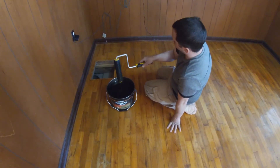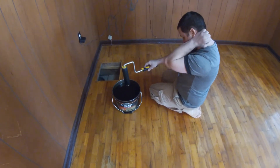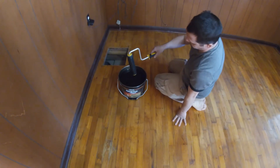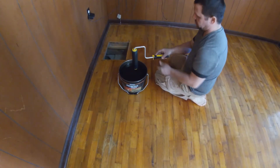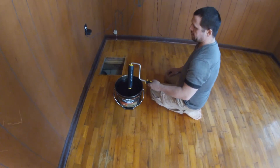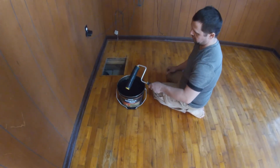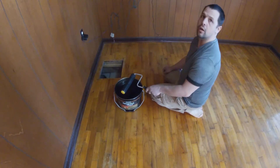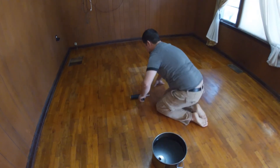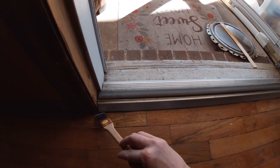All right, we're getting ready, starting in this corner. I use a big oversized bucket where I can get a roller and just dip the whole thing in. After I pull it out, I let it drip for a little bit, and once it slows down, I start rolling. When you do it close to the walls, you want the arm away so you can get as close as you can to that edge. Then I'll finish up with a brush around the vents and stuff with the paintbrush, and around the front door, because I want it to be good and sealed.